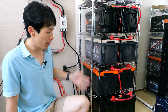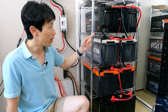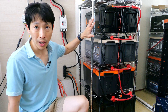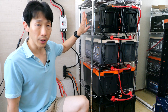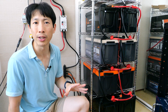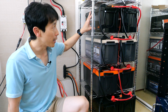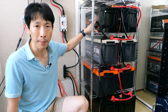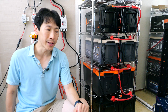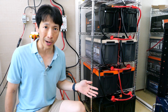But by the time you do all this — the cost of all these cables, the lugs, the battery balancer, the shelf, the silicone terminals, the straps — I estimate this to be probably around $300 for all the extra things you have to buy in order to put eight of these 200 amp hour batteries into one big battery bank. Having done this, I kind of feel it's a lot more elegant if you just buy a server rack battery.